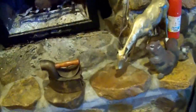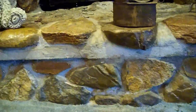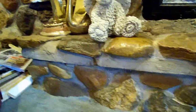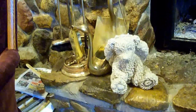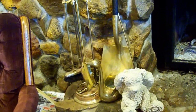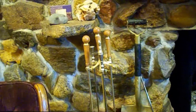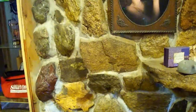To keep the stone up against the wall, I put screws in all over the place in between the rocks. There's some block underneath it — just regular basement block to build it up. I'd build about a foot of stone a day and put some screws in, let it dry up so it wouldn't come down.